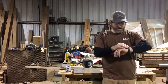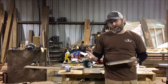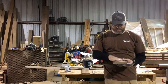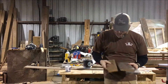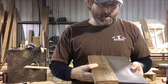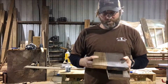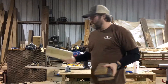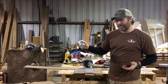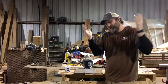It's about 12:30 now, back in the shop finally. The boards I treated with the Weather Wash are dry. Not going to lie, they're still a lot grayer than I was really hoping. I can see some brown tints, some brown undertones on the boards. This is the barnwood and this is the oak — it's close, but it's still kind of gray. The pine has some brown undertones but still has a grayish look and feel to it. The poplar is completely gray — there's no brown on it, so don't use poplar. I'm going to try the maintenance oil and see if that does anything to it. I have to wait 12 hours, and we'll make a decision then.